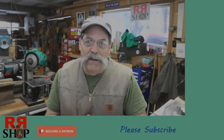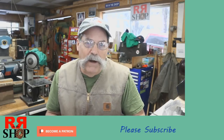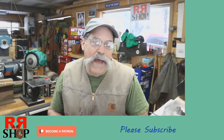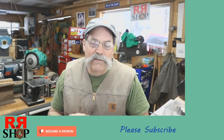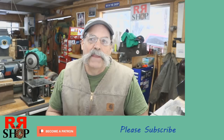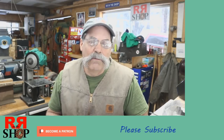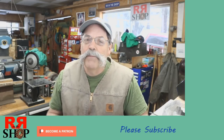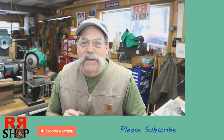The cement mixer. So we're going to do the bearings, the two main journal bearings on the cement mixer. If you remember, I talked about this before, the bearing shells are cast iron shells. They had no bearings in them. They were just cast iron on cast iron, and they have some signs of wear. I'll show you that in the bottom of the shell. But they're not too bad, and they're tapered a little bit.